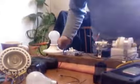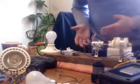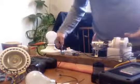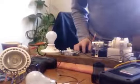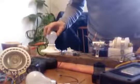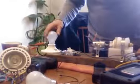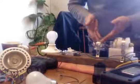Anyways, anybody who wants to try this, it works 100%. And there's no transformers. I haven't used a transformer here like Gerard does, and I have no pig pole like on the video there. Nothing. Just straight out of the motor into the switch, into the light, away you go. Very simple. If these were 20-watt bulbs, for instance, I could light up 5 of them spinning this with a 12-volt battery. No big deal.